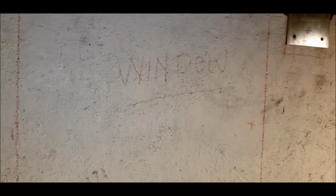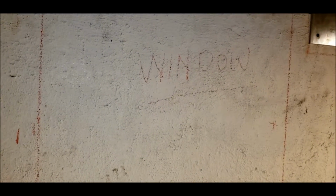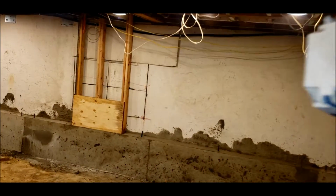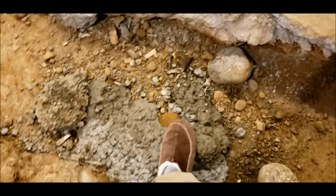They're all around. We're getting ready to cut out a new window here. See that? We're going to have the same size window as that one, but additional here. It's required by the city for a certain daylight amount. So there'll be a new window there. That's kind of neat. And then the egress window is going to be there. I got to watch where I'm stepping.